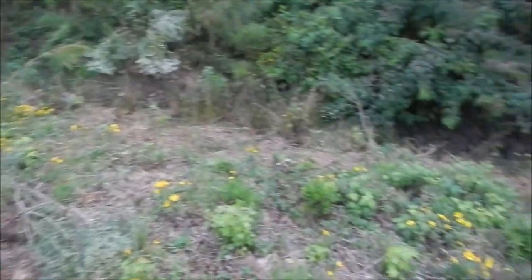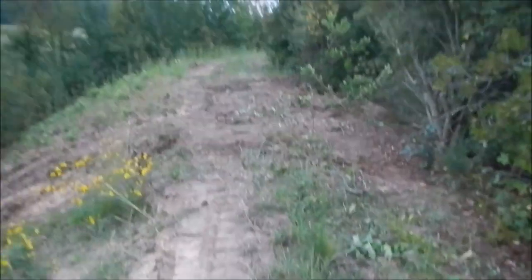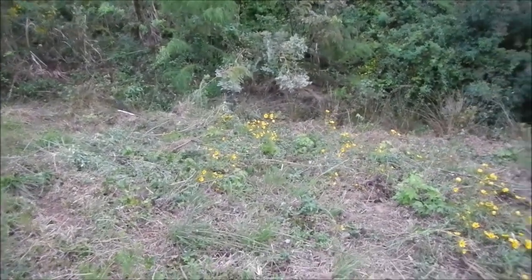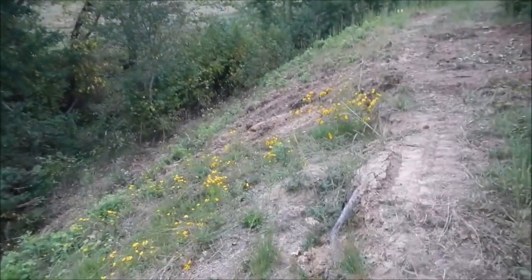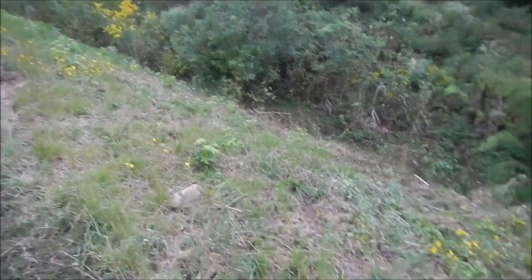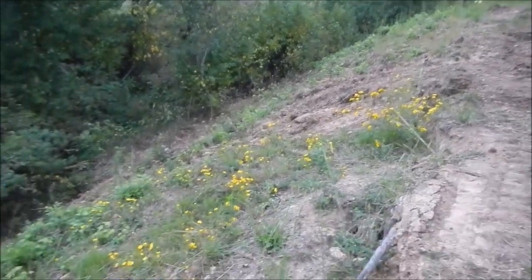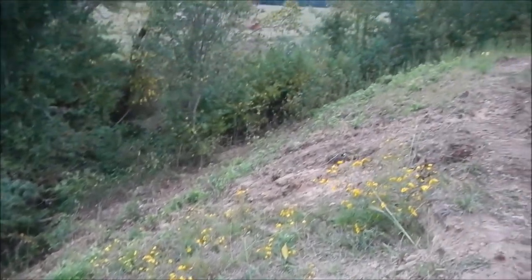We came in with the Yanmar yesterday and ripped out the little bushes. We've got the 160 coming to speed things up. We're going to go all the way to the toe of this slope and cut it down a foot to two feet, tapering it back, cutting this bad dirt out. We dug a hole over here five feet and it's still just as wet and mushy as it could be, but the engineer wants to skim some off the top and fill it back in with rock all the way down — all rock on the back side of this dam for 80 feet. That should stabilize it from trying to wash or slide. Probably about a two-day project.